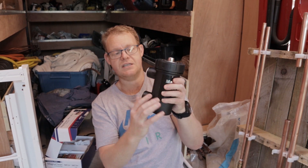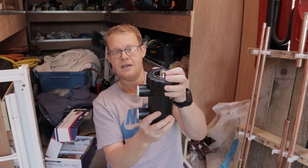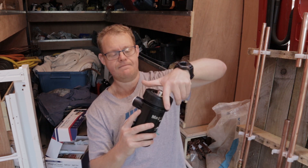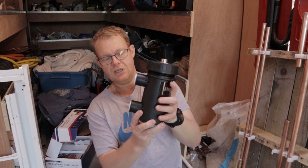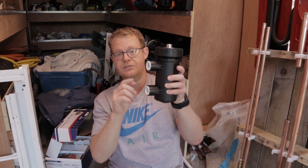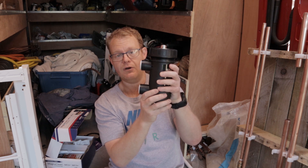Inside this filter there is a magnet on this collar here, which we can take out by unscrewing the lid. The filter will be piped in to the pipework. The best place to fit the filter is on the return, the main return back to the boiler. If you're on a combination boiler, you want to fit it just underneath the boiler. The reason you fit it on the return is that when the boiler is pumping water out, eventually all that water is going to be coming back on the return side into the boiler, going back through the filter.